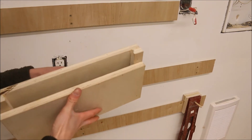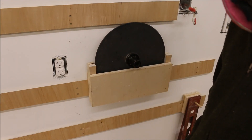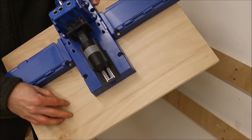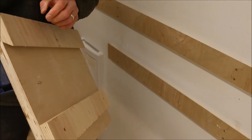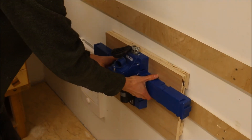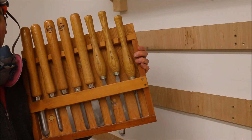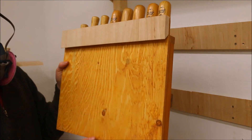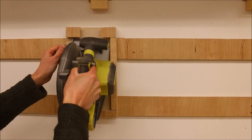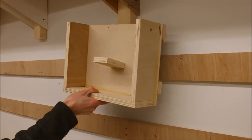There's a front piece just to hold it in, so we can put this on the wall. We take my disc sander and put it in the slot — when it's time to use it, it comes out nice and easy. Now my pocket hole jig holder is extremely easy — just a piece of three quarter inch plywood with my French cleat on the back and a random scrap screwed to the board, and we can just hang it on there. I can thank my grandfather for this because he actually built his own holder that he screwed into his studs in his workshop for his high-speed turning tools — all I did was put a French cleat on the back. We also put our circular saw on here, and we made one for my router, and one for my random orbital sander as well.